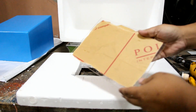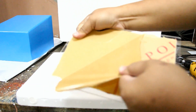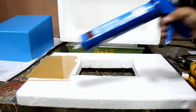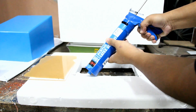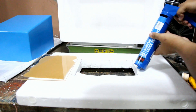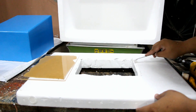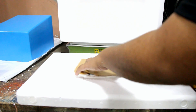Now let us attach our acrylic sheet to our window. We will remove the protective covering and apply sealant to the top cover. Apply a thin bead of sealant around the perimeter of the top cover. Using a clean tool, spread the sealant evenly. Now place your acrylic sheet on top of the window and apply pressure around the perimeter so the sealant will spread.